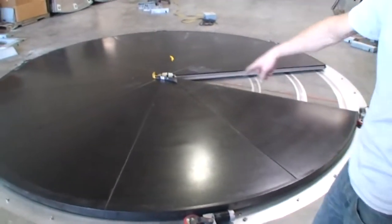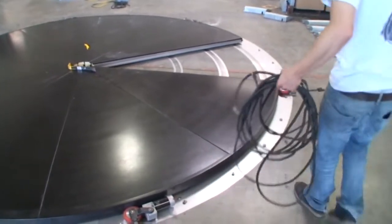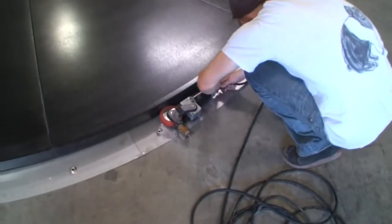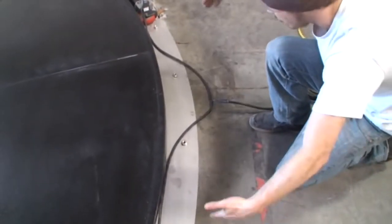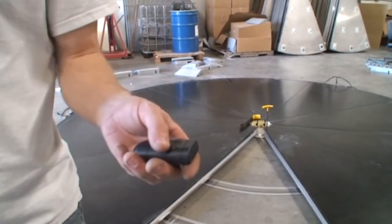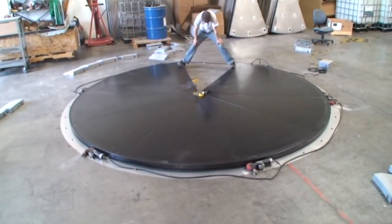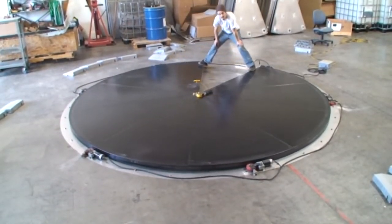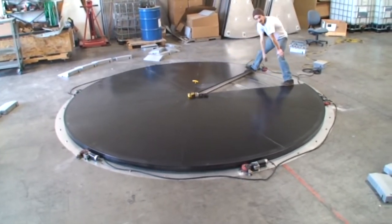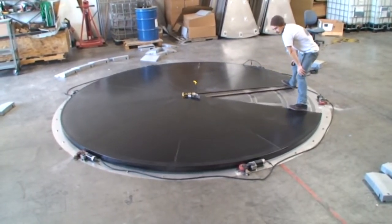The wire harness is a split wire harness, meaning with six motors, your power will come in with three motors to the right and three motors to the left. The power comes in in the middle of your desired motor round. With the power connected and remote in hand, brace your feet on each panel between the final panel slot and turn on. Be careful because there will be a slight jolt. Turn around a few times and inspect the spider for dropped bolts, debris, or unfolded tabs.